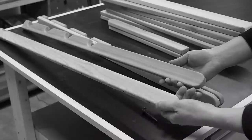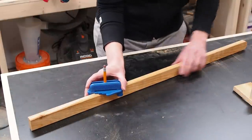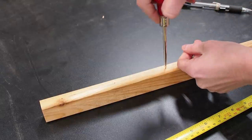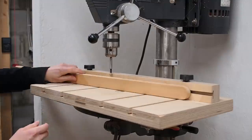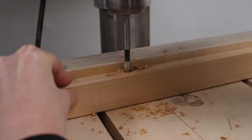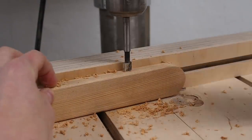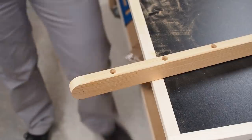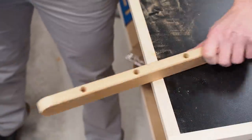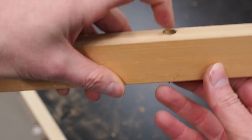Next I need to make the pieces that will support the back slats. I first marked a line down the center of the back of the slat, then measured and marked evenly spaced reference marks. I want to make countersunk holes for the screws, and I decided to use the drill press so I could set the depth stop and control the depth I'm drilling at. After that I could use a regular bit to drill all the way through, using a bit large enough to allow the screw to pass through.